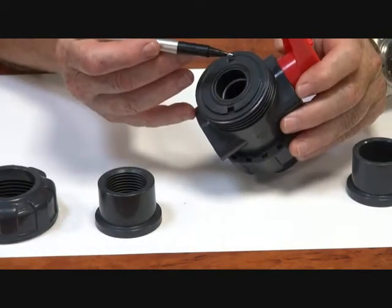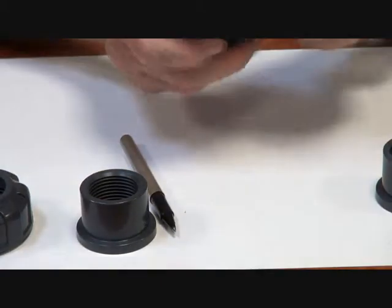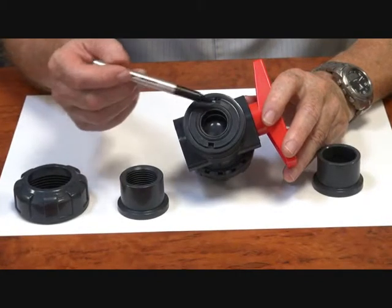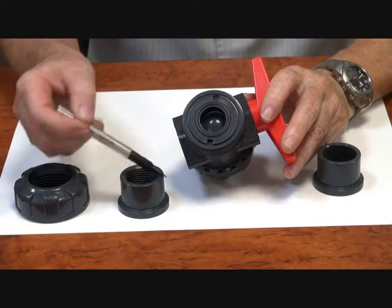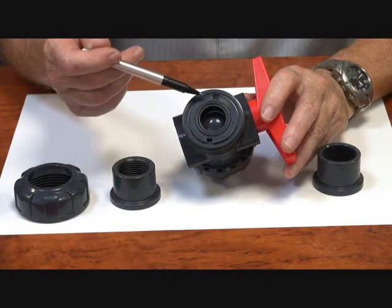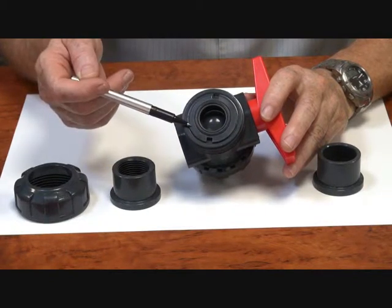The unit has a safety block type design, so that if necessary, if it's turned off, the valve is rotated off and you remove this end off the pipework. In some cheaper ball valves, this safety block is just an insert held into place, but in this case it's actually screwed in, so it's a proper chemical safety block. The ball valve won't cock over and leak chemicals out — the idea is it can be removed safely in the off position.